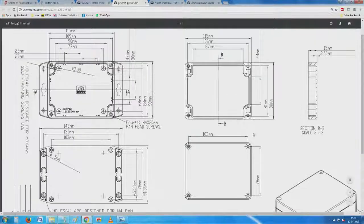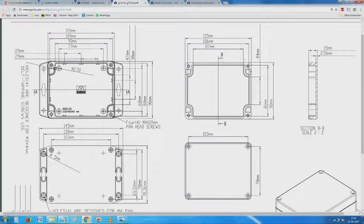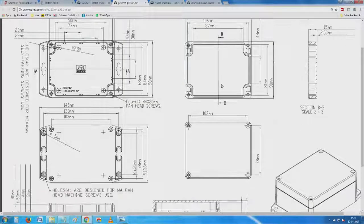Every small detail says what comes on top and what comes here. If you were to place any detail to occupy this space, you see here that I have a place of 87 mm. So something which is 87 mm or maybe 85 mm wide by around, say, 80 mm can be put like this. Alternatively, I can have this small thing. Otherwise, if I notch off these corners, I can have a PCB which sits nicely inside.